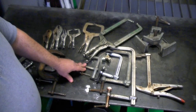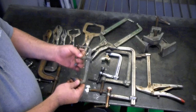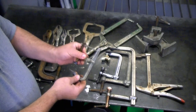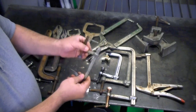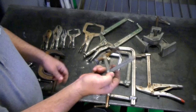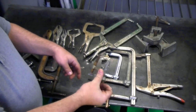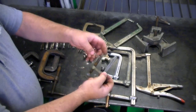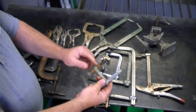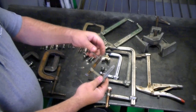Next we have what I call the sliding bar clamps. They range in size and you can see how fast these are to adjust. They work off a cantilever principle where the friction does the holding for you. You can slide one of these up or down very quickly, and you can actually do it one-handed for most of them. So you can have a free hand holding whatever you're trying to clamp, slide this up and down to get it set, then turn it once you get close. You don't have quite as long a turn, but you can put more pressure on it if you need to.